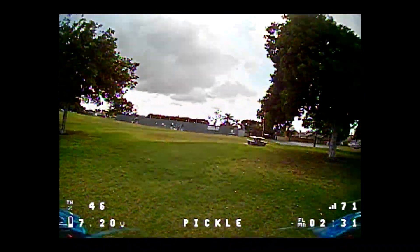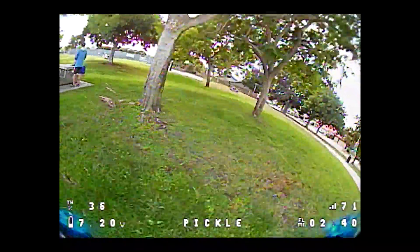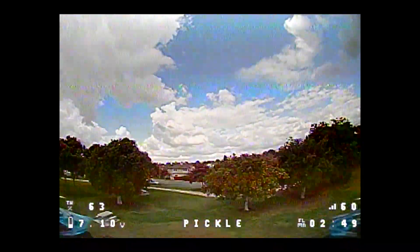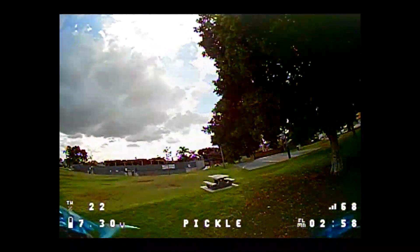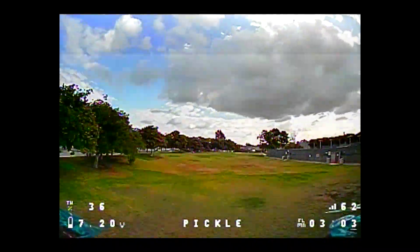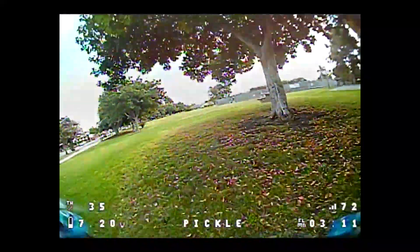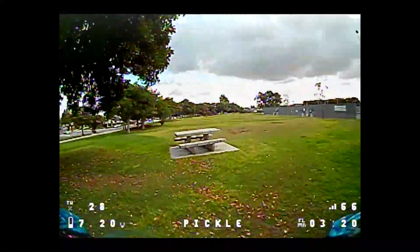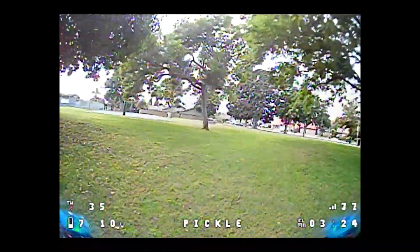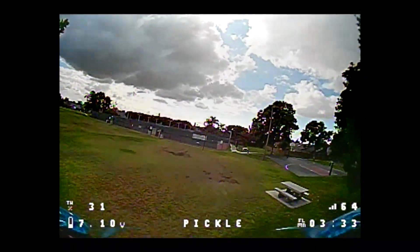I'm just getting a little bit of bounce backs. It's on the roll axis — I can't tell if it's happening on the pitch axis as well. Yeah, I'm getting bounce backs on both the pitch and roll axis. That probably just means I need to increase D — D-min is probably too low. This is actually the first build on Betaflight 4.1 where it didn't fly almost perfect out of the box on the default tune. I guess you can't always get away without tuning at all.